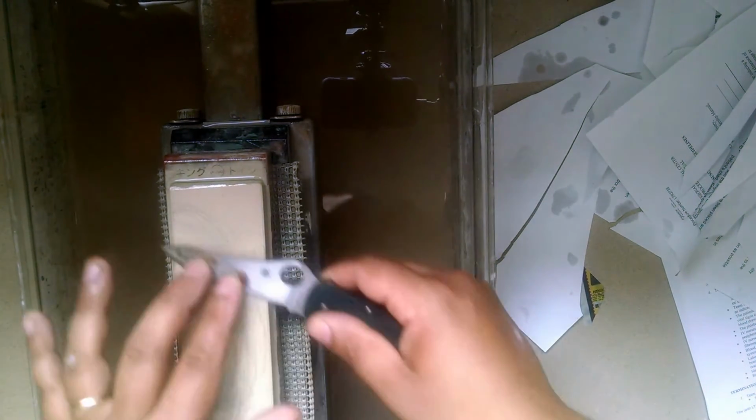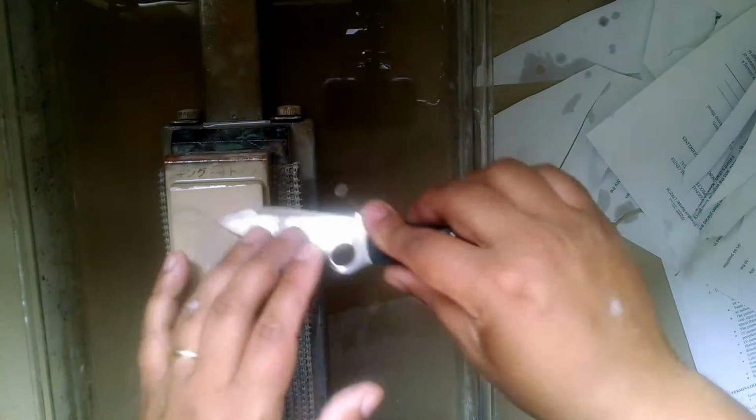If you have excellent consistency with your sharpening though, then you don't have to worry as much about rounding over the apex. But the more stones you work the edge up on, it's almost inevitable that you're going to have some rounding. Of course, people with great talent are able to work up an incredible amount of different stones freehand without ever having to worry about that. I've done so in the past, but it just seems to take a lot of effort to make sure that each pass is super consistent.